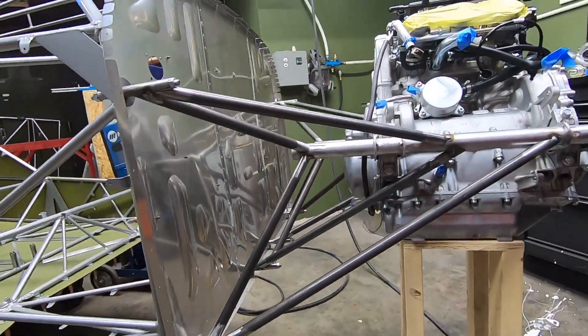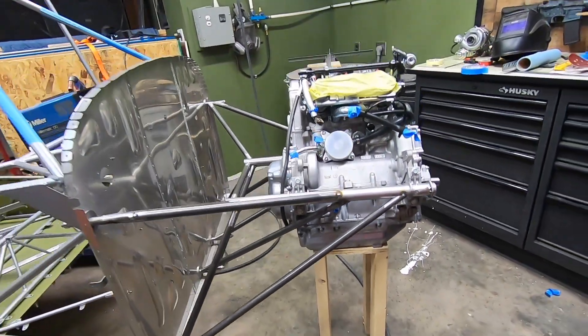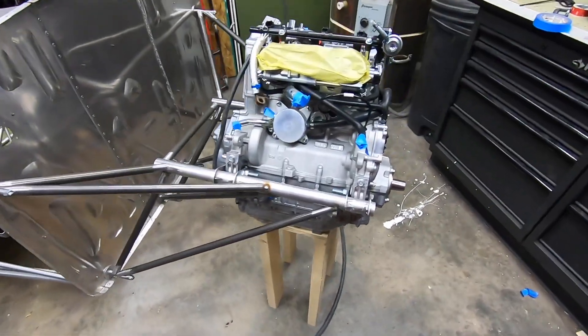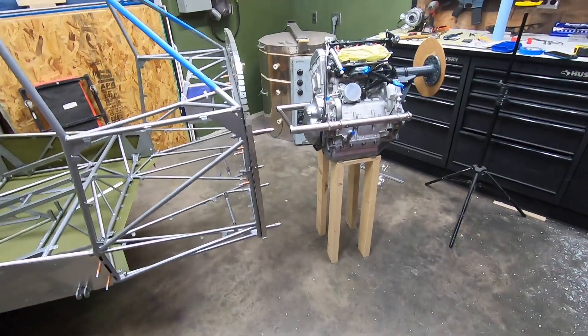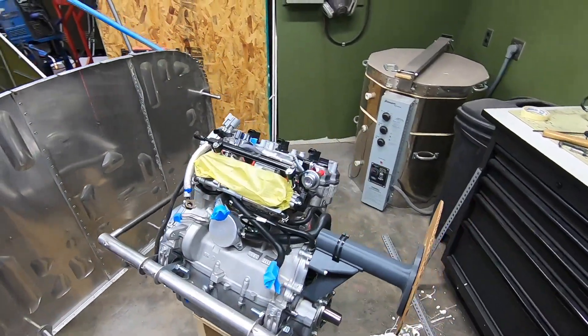While on the S21, I have plenty of room. Some guys with narrower firewalls were having trouble fitting the exhaust manifold within the cowl. Since Skytrax hadn't moved into production on the three-cylinder gearbox yet, he decided on moving the planned prop shaft location a bit to the pilot's side. This would open up this setup to more aircraft variants, but it did mean that I needed to shift things over a bit and recenter my prop flange on the firewall.